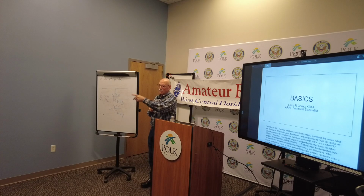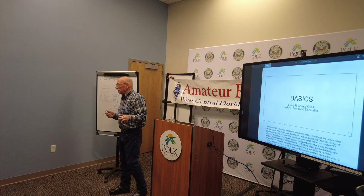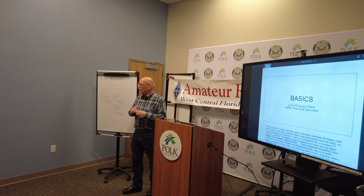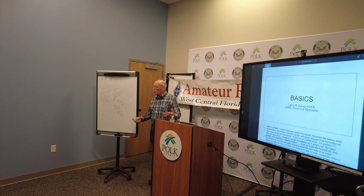What's it relative to? I mentioned it earlier. Antenna measurements are relative to wavelength. The wavelength of 80 meters is what? 265 feet, thereabouts. People say, I got a long wire up. How long is it? 50 feet. That's not a long wire on 80 meters. It may be a long wire on 2 meters.